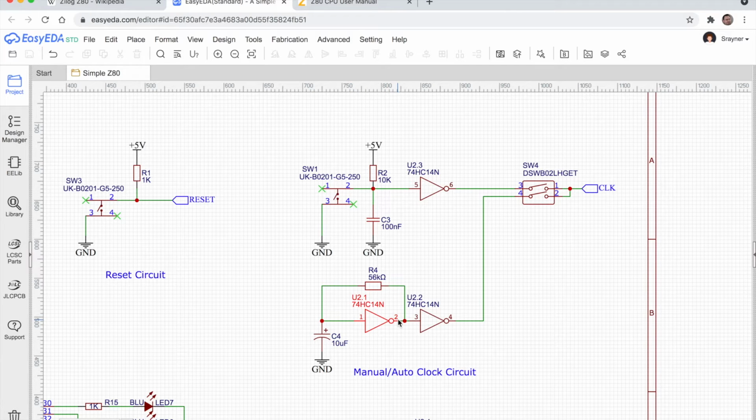The current will stop flowing, the capacitor will discharge, the voltage will drop down low, and when it drops to a certain point, it will switch again. And it will just keep switching backwards and forwards between high and low, and the frequency, which allegedly is about 2 Hertz, but I think I measured it a little bit different than that.